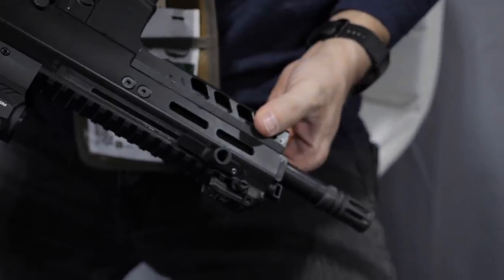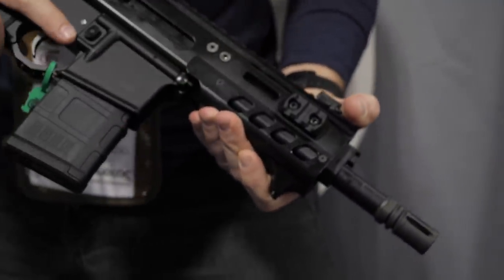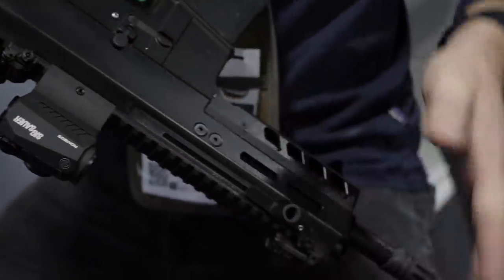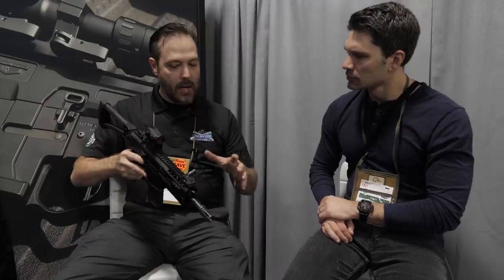Yep. And that wasn't in the original design, you know, so I'm designing this gun the way I want it. And this is where I want my charging handle. So you charge it back with this hand, and you have access to your bolt catch. Oh, cool. So that's all brilliant, actually. Yeah. And your other controls are with this hand, so everything fits where it's supposed to be. As a right-handed shooter, I don't want to reach around the gun to charge it. You do it with the AK because you have to. Right, and it kind of looks cool. You don't have to with this gun.